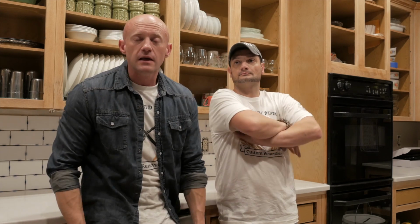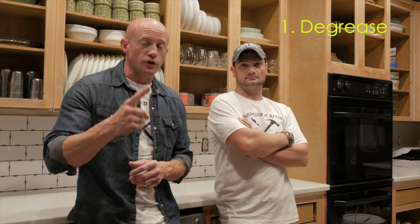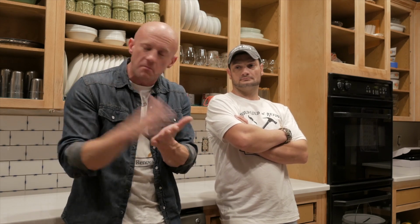So if you, again, watch this cabinet video, I'm going to link it again. Check it out, because it shows you our process step by step. We degrease first. Degrease first before you sand. Why? Because if you just sand, then you are actually just smashing that grease into the grain, especially if they're oak cabinets. So degrease first with a scrubber. Get it all out of there. Number one, degrease.